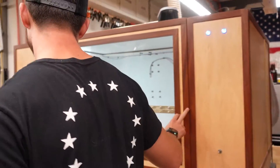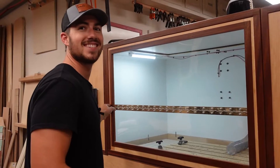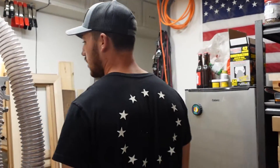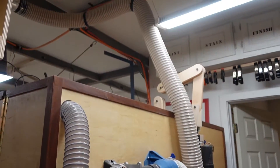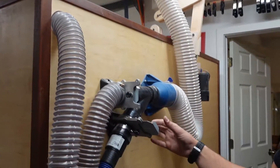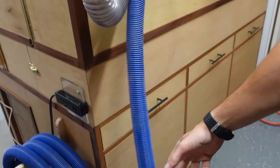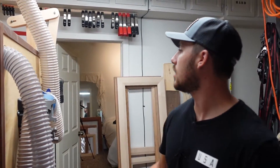There are some magnets so this stays closed — it actually keeps out a lot of the noise. I've got all my dust collection hooked up here. As you can see, everything is piped in: four inch down to two and a half, two and a half down to about one and three quarters. All your blast gates are back here — this one goes into the enclosure and hooks up to the CNC machine, and this one is kind of a floor sweep.